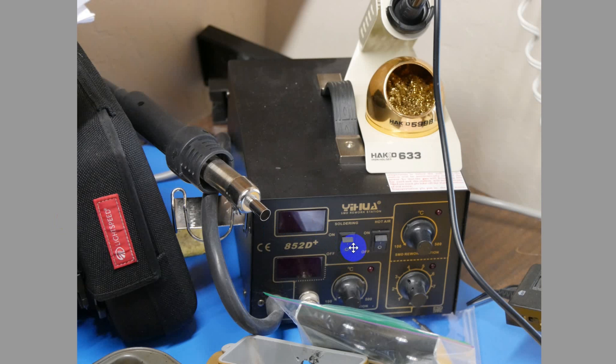This is my soldering station — it's actually a surface mount device rework station. It has a hot air gun which can put ridiculously hot air out of it. You've got to be careful because it will start a fire. This is my holder for the soldering pencil, and I can control the temperature in degrees centigrade. The hot air is hot enough to solder a joint. You use this to remove an SMD component by heating all pins simultaneously. You've got a volume control for the amount of air and a temperature control.